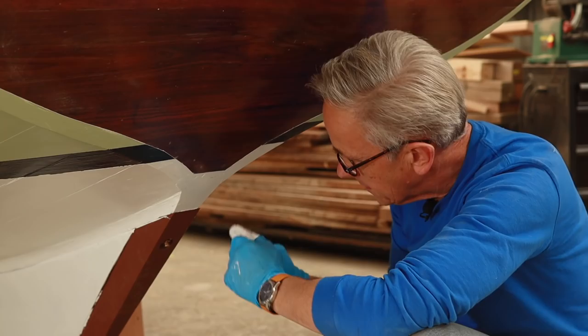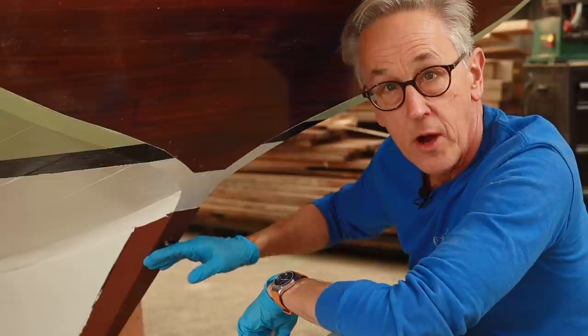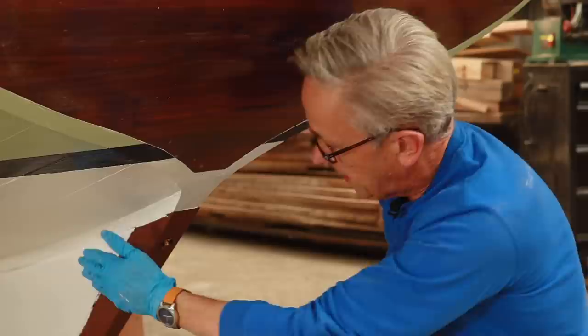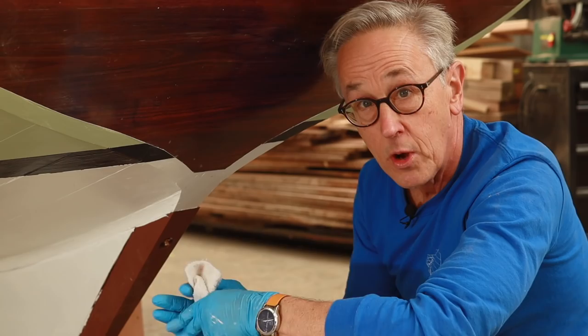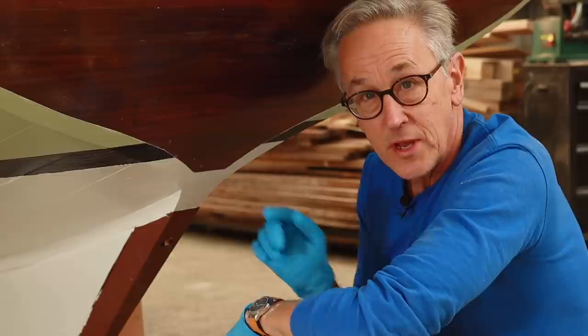All right, that should do it for getting the stern post and the deadwood attached to the boat. Now all of these bolts will get cut off and they'll be plugged with fairing compound. And in addition, all of the deadwood and the keel and the stern post will all be faired together with some fairing compound, so it'll look like one complete unit before the boat goes in the water. So now we can turn our attention to attaching the lead keel.